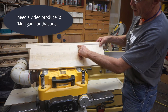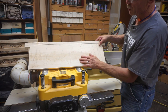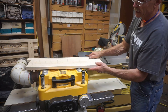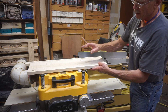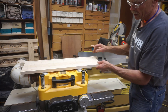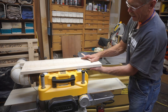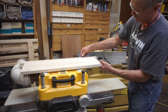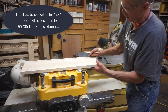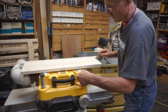The next step is to plane off this lug. I'll add squiggle marks, paying special attention to this rabbited edge where the lug and the flat surface join. All I do is flip the piece with the full flat side down and run it through the planer with the lug side up. As long as this lug is less than an eighth of an inch, I can use the same planer setting and the planer will take care of this thickness. If it's five sixteenths or so, I have to raise the planer accordingly and then bring this lug down until the whole thing will go through in one pass.